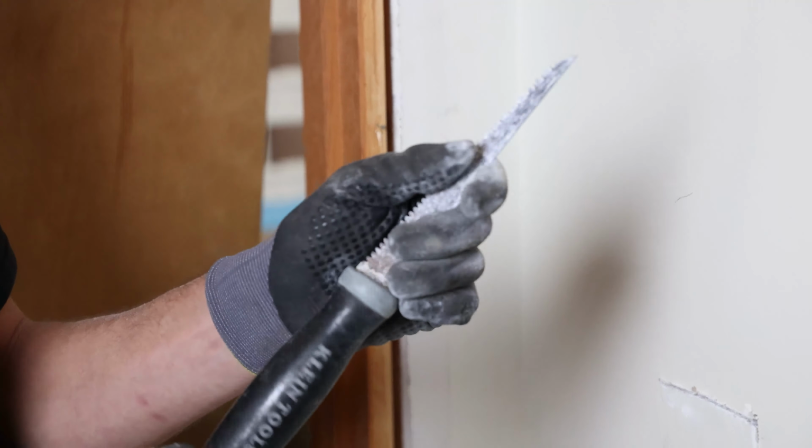Basic, easy rule of thumb, which is overly conservative in some cases, is 3 cables in 1 bored hole like that, max. And these fit easily. So if your wiring fits without damaging the insulation, if you can pull smoothly and you max out at 3, you're good to go. You're safe. You're playing it cautiously. You're not going to run into problems.